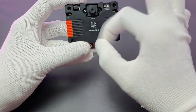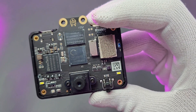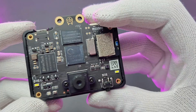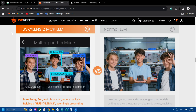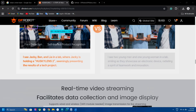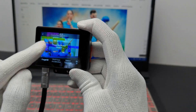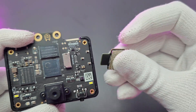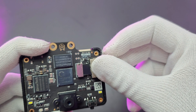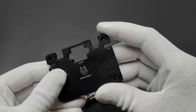The body is made with some alloy or metal. Now let's remove the back cover and see what's inside. Here you can see the Kendryte K230 processor, which is powerful enough to run AI models and algorithms. It's a 1.6 GHz dual-core processor and it can operate at 6 tera operations per second, which is super fast for a development board. HuskyLens 2 comes with MCP service, meaning large language models can run accurately — for example, HuskyLens can not only detect a person but also precisely identify who it is. There is also a removable Wi-Fi card which gives Wi-Fi connectivity to HuskyLens. The back cover also acts as a heatsink for the processor.